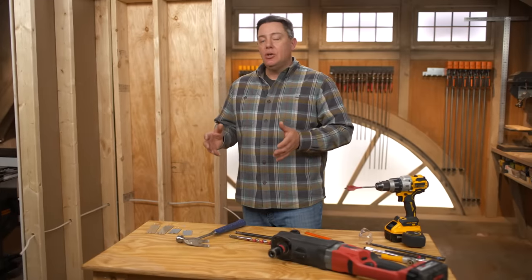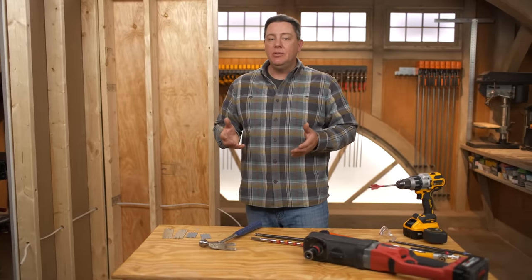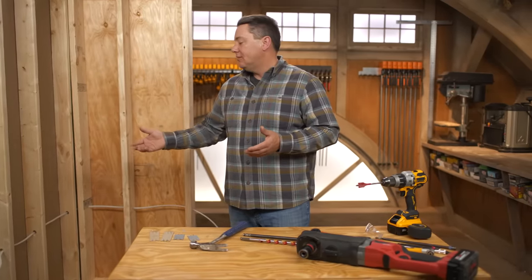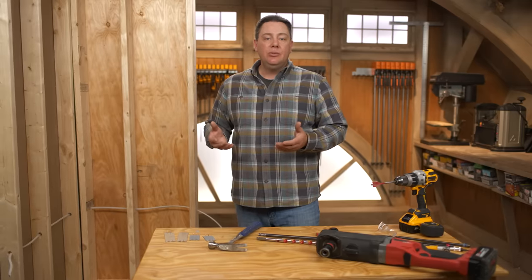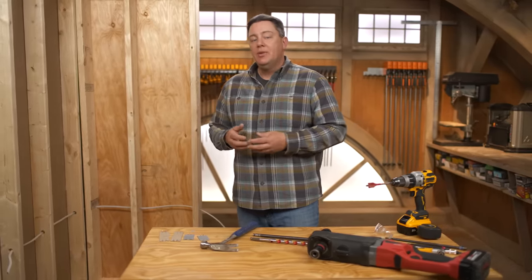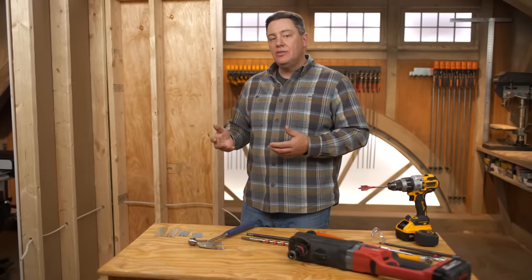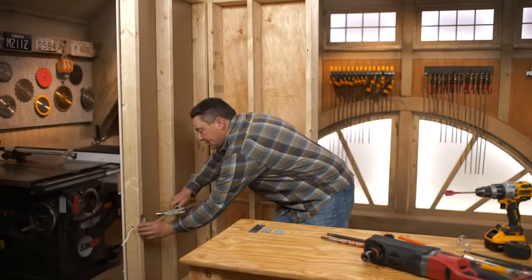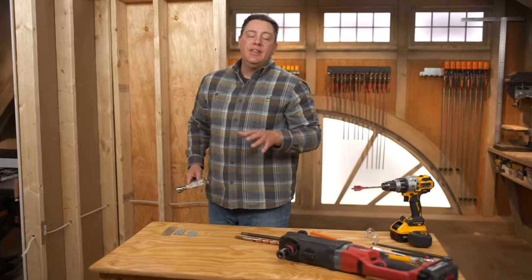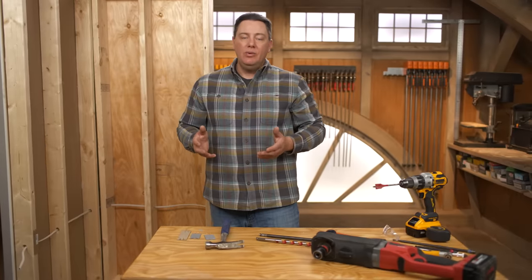These are some of the tips and techniques for drilling holes through a framed wall to pull a single cable and dealing with corners you might run into. If you're going to be running multiple cables, you can increase the hole size to a certain point, but you're limited by your clearance from the edge and how many cables you're allowed to pull through. Make sure you check with your local inspector to see what's permitted. And if you can't always get that inch-and-a-quarter clearance, the solution is to install a nail plate to cover and protect that space — keeping a nail or screw from hitting the wire. Always have the right tool and sharp drill bits to make these jobs easier. Thanks for watching.